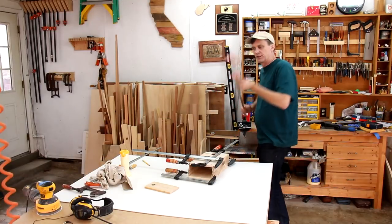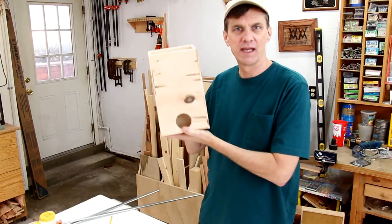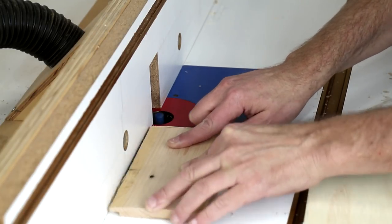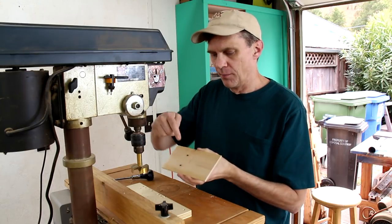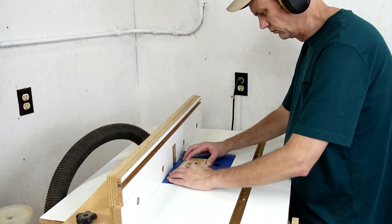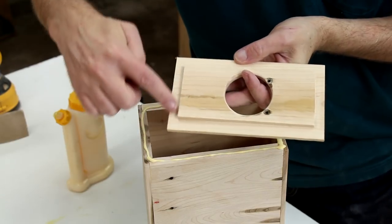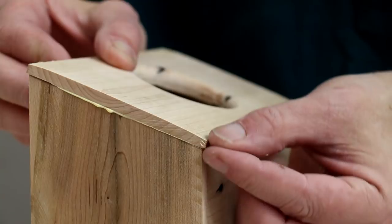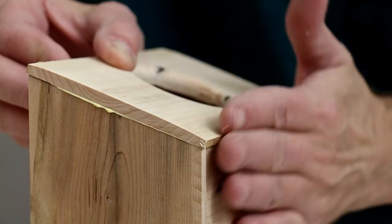It's been about an hour so I can take all the clamps off. Well, if it's not a plastic bag dispenser it could also be a birdhouse. The top of the box is slightly wider because it's at an angle — I'm going to make a hole in the center of it now. Then I'll round over these inside edges. These rabbets around the top will just drop right onto the edges. Since this overhang is so thin, rather than cut it at that 20 degree angle I'm just going to sand it flush with the front.